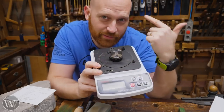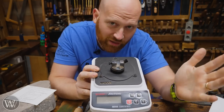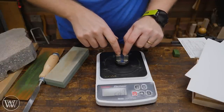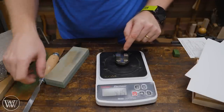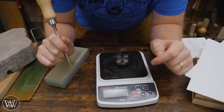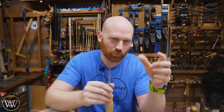To demonstrate, I'm bringing in my sharpness tester. I've had this for many years and I've put thousands and thousands of tests through this — probably well over 10,000 by now. This thing measures how much force is applied: there is a measured filament inside that will get sliced, and the pressure needed to slice that fiber tells you how sharp it is. Right now it's about 150. The sharpest you can possibly get with the best steel in the world is around 75. Anything under 150 is incredibly sharp — that's where I want something to be for a smoothing plane. For general work I'll usually let it get up to around 300, but somewhere between 300 and 400 I'm going to be sharpening it again.